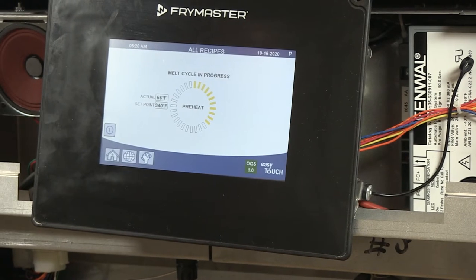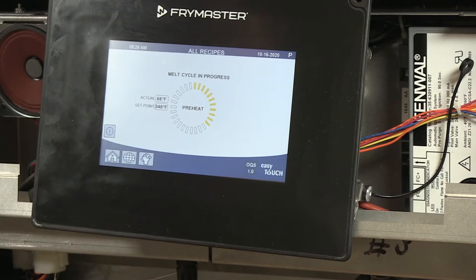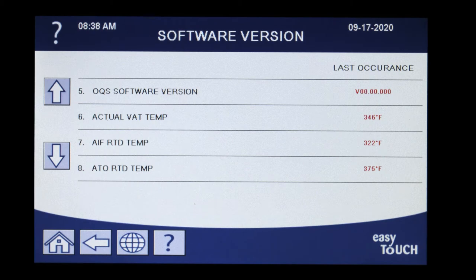The Filter Quick 4000 touchscreen controller can be used during troubleshooting. Carefully attach it to the cabinetry — with it in place, the fryer can be tested. A successful ignition is visible through the observation ports at the front of the fryer. A diagnostic screen accessible in tech mode allows pumps, relays, and valves to be tested. The software screen, available with the press of the question mark, shows version numbers and the temperature of the three probes in the fry pot. Both are useful diagnostic tools. Wide differences in the displayed probe temperatures can point to probe problems, assuming all probes are in the oil.